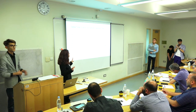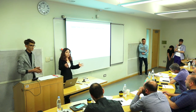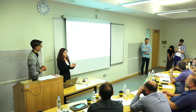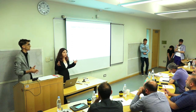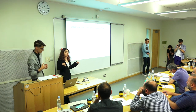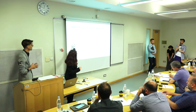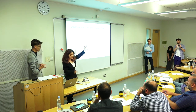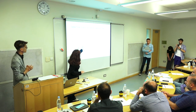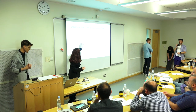So we did approximate calculations of what the battery operation time would be. In this case, it's not measured in seconds or hours, but in how many pages can be displayed. We took 14 characters as our page. The current consumed when pushing or pulling the pin with this design is 0.9 amperes. The time it takes to display a page of 14 characters would be 10 milliseconds times 14 times 6, and we supply it with 12 volts of voltage.